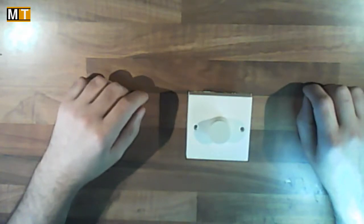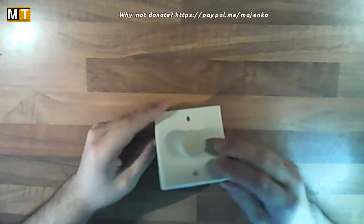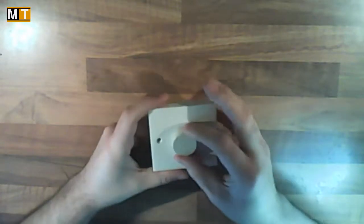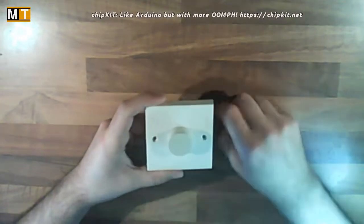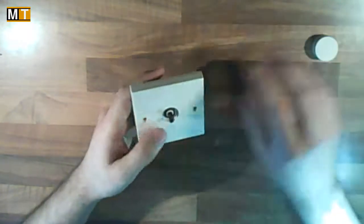Today's little project: I've just had to replace a dimmer switch where one has failed, so I thought I'd rip it apart and see exactly what has failed with it. The symptom is the knob just turns and turns and turns. It's supposed to go all the way to one end, click off, then click on and turn up to the other end and stop — but no, no click, just turns and turns and turns. I would imagine the potentiometer is completely dead.